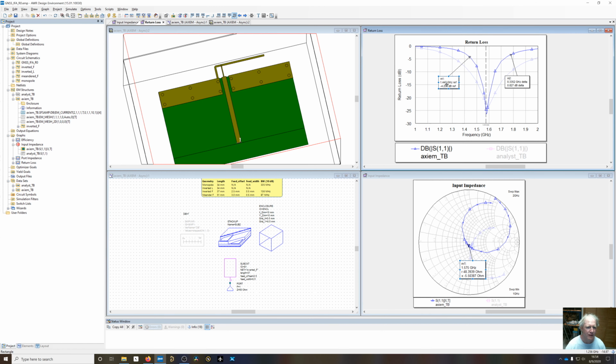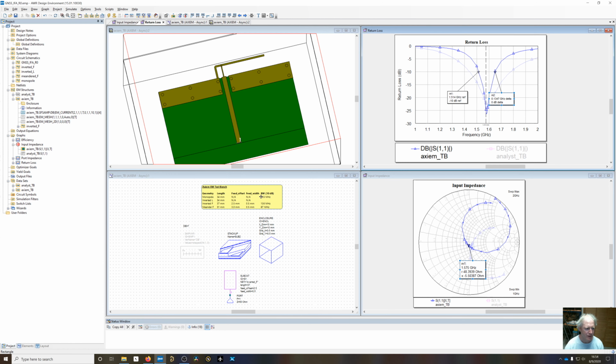So now the impedance is looking pretty good. The bandwidth has decreased. If I go to marker search and tell that to go to a Y value of -10, and we want to search right, and do the same thing for the delta marker, except search left. Now our bandwidth has collapsed to 134 megahertz. I think I had 136 megahertz written on here. So going from the monopole to the inverted F, we've lost a good amount of bandwidth. We still got a pretty good return loss.